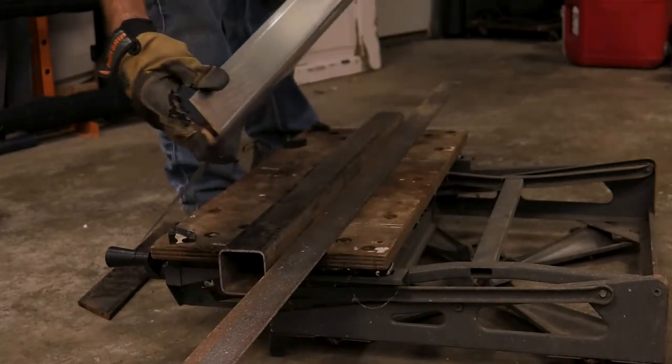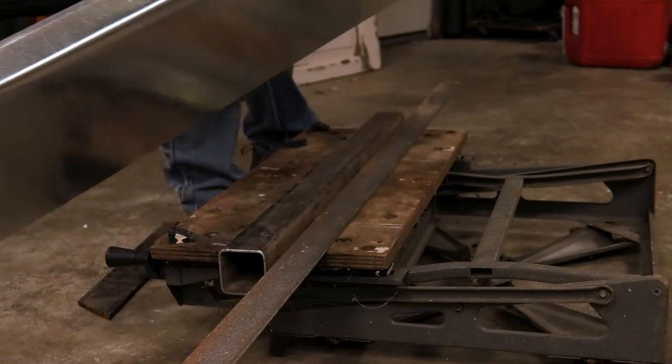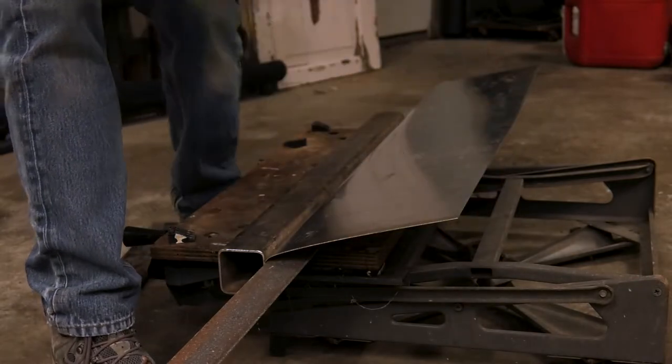The bends on the ends came out fairly nice. To tighten up the bends in the middle, use a small sledgehammer and some thick steel. Just make sure that steel has a smooth side and there's no sharp edges, or it will mark up your sheet metal. If you want that hammered look, then just grab your hammer and hammer away. Don't forget safety protection.